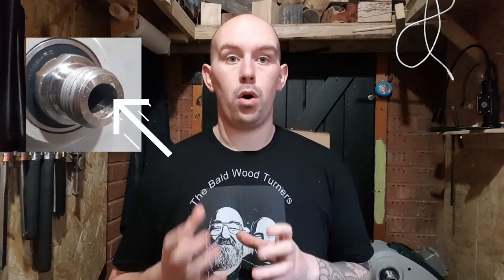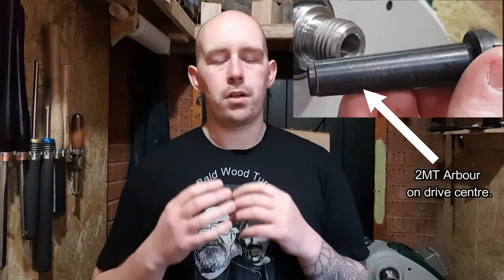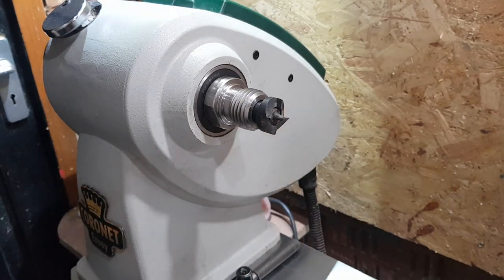The next important part of your spindle is the Morse taper. Basically your Morse taper is what holds your drive center in your spindle. To keep this simple, think of your spindle as a female — the spindle has a hollow housing that is tapered on the inside. The arbor on your drive center is the male, which has the corresponding Morse taper to fit inside of your spindle. This is held in by friction basically. The most common size of Morse taper is a 2 Morse taper. Older and much smaller lathes have a 1 Morse taper, and large lathes like the BB36 Master Bowl Turner has a 3 Morse taper.